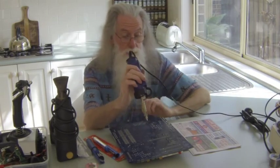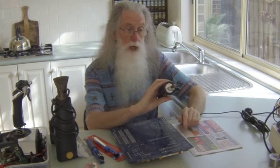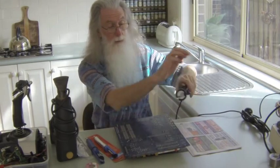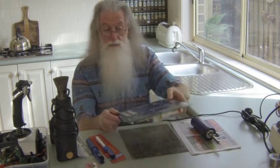What you do is: when you desolder, suck it up, bring it over to a bit of damp paper, then let it go — it sprays out but the damp paper means it doesn't spray all over the place and bounce around. So it's a semi sort of self-cleaning method. You let it heat up and that's how quickly it's done. Make sure you don't burn your hand or arm on the end of it. If you just want to remove one component quickly, they're quite good. I highly recommend them if you do a bit of desoldering or want to shift chips around — five bucks, you can't beat it.